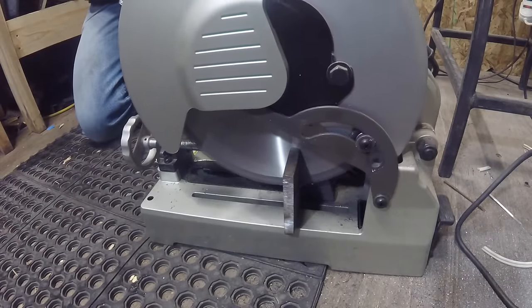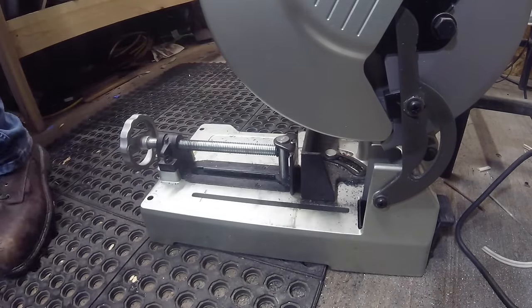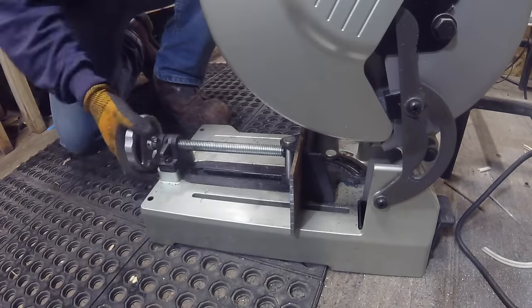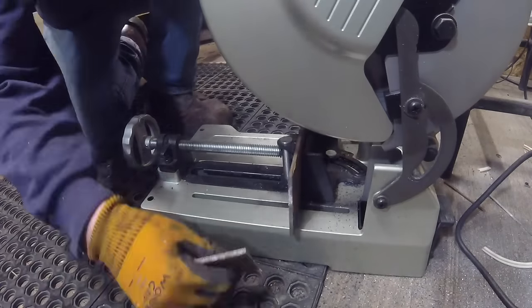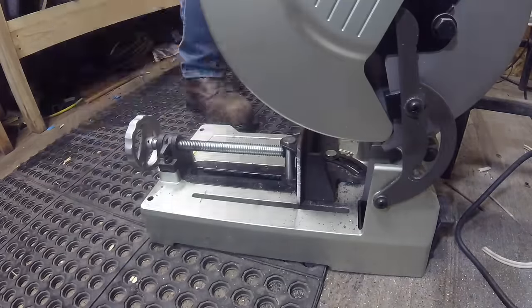I want the wheel to rest on the shoulder, so right as close to the bearings as possible. For the base, I just cut out that 3/8 piece of steel, and then I cut out a few pieces of the 1/8 material that's two and a quarter inches wide.